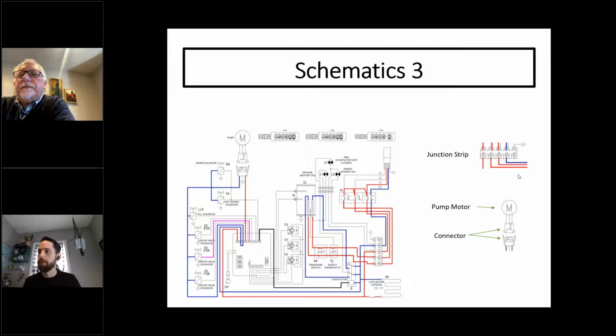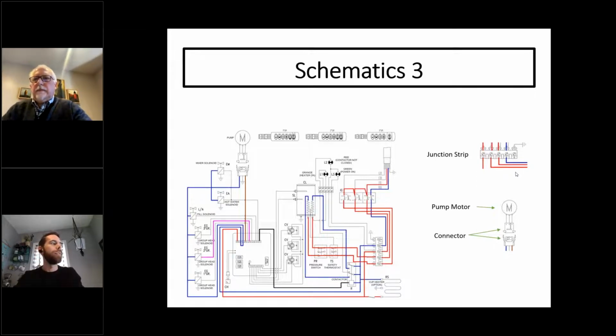All right. And then one other question. I've come across 110 volt machines before that were installed probably by less experienced technicians, where the ground and neutral were jumped together either at the terminal block or somewhere else. Yeah. What is the risk there? Well, the ground wire is never supposed to have current going through it. It's never supposed to have anything going back. So for example, if you were to hook that up to a GFI circuit on 110, because the neutral is always carrying current back, the GFI will sense that current and trip the breaker. Because the ground is like sacrosanct. It's supposed to be just static, nothing. It doesn't get to play with anything.